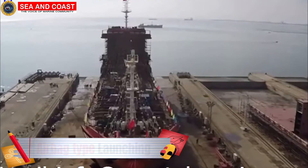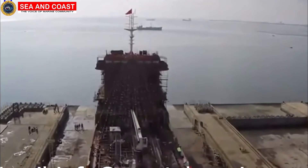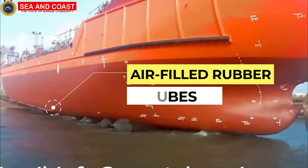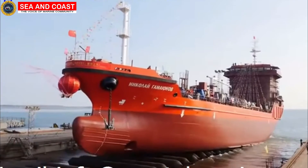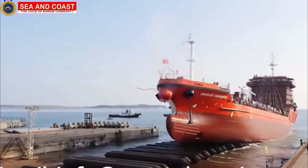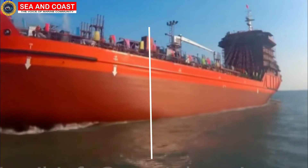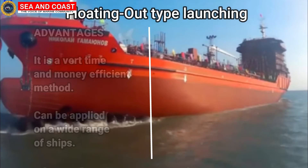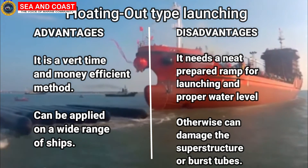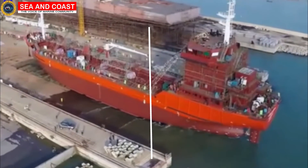We come to the last method of launching, which is a very innovative and versatile method for launching ships of any size into the water: the airbag launching method. It essentially consists of air-filled, reinforced rubber tubes with hemispherical ends and high load capacity. Many such tubes are placed one after another in a proper sequence on a slanted ramp and they guide the ship by the virtue of gravity into the water. Since they are air-filled, retrieving them from the surface of the water after the launch isn't a big deal either. Its advantages are that it is a very time and money efficient method and can be applied on a wide range of ships. However, this method is not as simple as it seems because it needs a neat prepared ramp for launching and proper water level, which otherwise can pose a danger to the ship or cause fracture or bursting of the airbags.